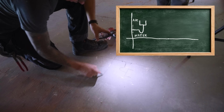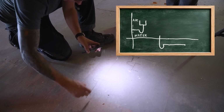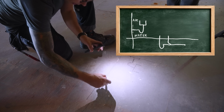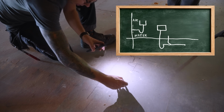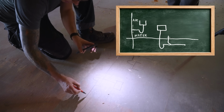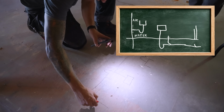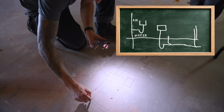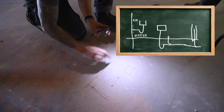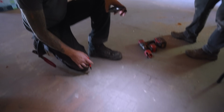Versus, same thing, here's your floor. What we're doing is we're coming down, there's your P-trap, there's your pipe. That's the 2 holes we just drilled over there. This pipe now comes up, ties onto your sink. This pipe gets cut off. And this allows us to clean. And as you work your way back, we're gonna put a pipe and pretend there's a wall here. We're gonna come up and then we're gonna drill a hole and we're gonna come through the wall. And that's your back vent because we're back of the main drainage. And how far can you be from that? 5'11" on an 1.5 inch.